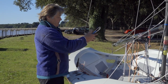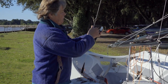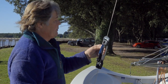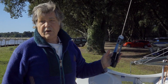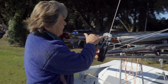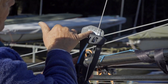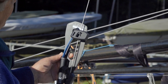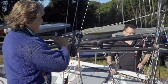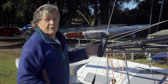I'm going to set this up here now and Dave will have to adjust the rig according to what I'm going to ask him. We're looking for 150 kilos on this setting. This particular gauge is showing it up here — it's just under at the moment, about 135. A little bit more Dave — that's beautiful. Okay, we're smack on 150, taking the shroud a little bit above here because if you're too close it doesn't work very effectively.